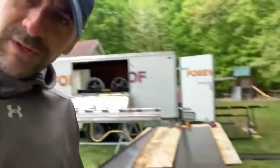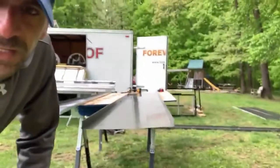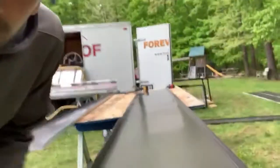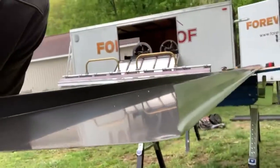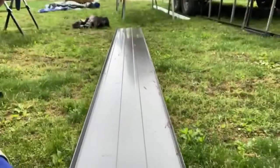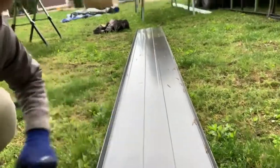And here's how the panel starts right here. So check that out. It's a 1.5 inch clip lock panel. That's what we're doing today. I have removed all these striations in that panel. I took them out of the machine. So we run striations in the machine quite often on the panel. And what that looks like is, here's a panel I ran earlier out of the machine. You see those two beads right here in the middle? Those two beads add strength to the panel and it helps reduce oil canning.